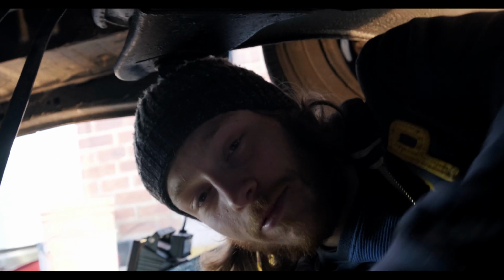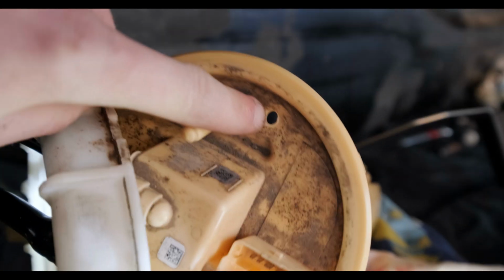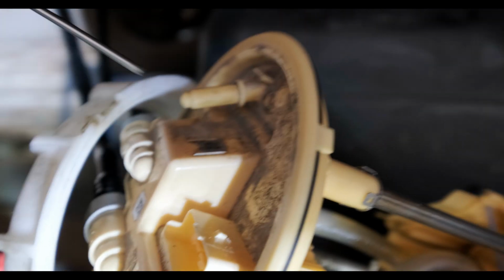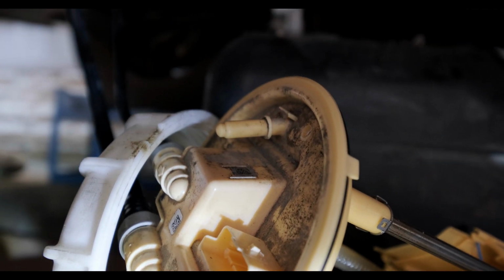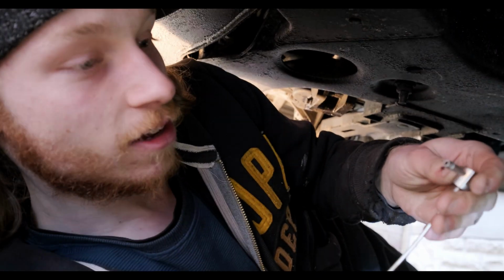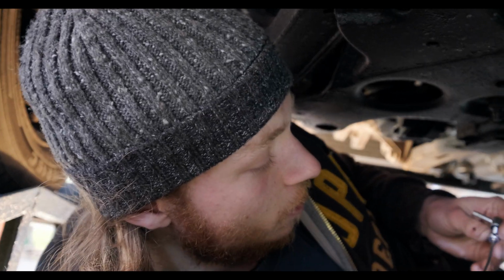Okay, so welcome to the underside of the van. It's a bit cramped under here, and we've got a little fuel standpipe thing. And this is the sender unit. And I've just drilled this hole through here. It comes out on the other side, and essentially the pipe will just go in here like that, and the heater will connect to this piece here, and that will feed the diesel into the pump and up to the heater, so we don't have to use a separate tank. But yeah, we'll just get this fixed in, and we'll get the tank back on.